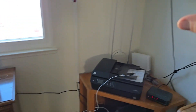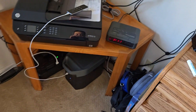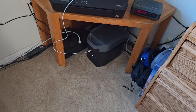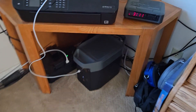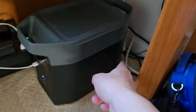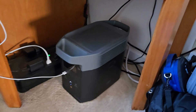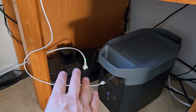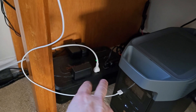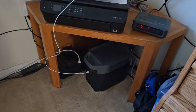I pretty much have all this equipment in this room — the TV and everything — running off-grid right now. If I turn on the wall outlet I'm back on the grid, but I only do that if needed. Thanks a lot, PG&E, for messing up our costs. I have a power strip and a UPS in the back; non-sensitive devices are on a surge-protected power strip, while sensitive electronics like security cameras, computer components, and the modem are all on the UPS. The UPS is powered by the Delta 2, as is the power strip — everything is supported by this unit.